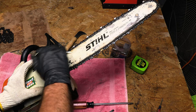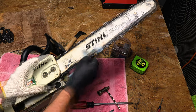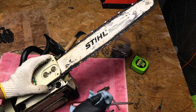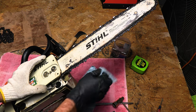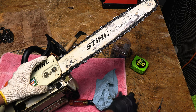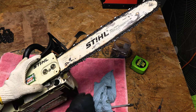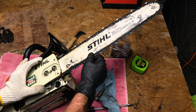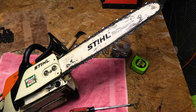You really should be wearing gloves while you're doing this. Make sure that's rolling pretty good and smooth. Go ahead and tighten this up a little bit more. Now after you've made your first few cuts, this chain may stretch a little bit and this might start to get loose again. If that happens, just loosen it up so that you got some movement there and just take your screwdriver and add just a little bit of tension back so that it's tight again. That's all there is to replacing a chain on one of these things.